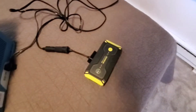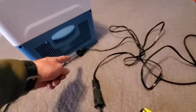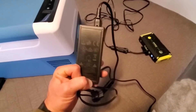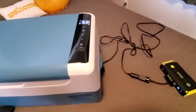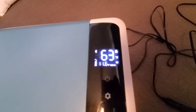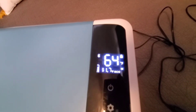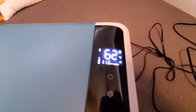All right, we're here with the Power Run. This is the adapter - you just plug it in there, I'm at 98%. Then this one goes to the DC output. This is super cool because it's a DC 12 and 24 volt output - but you lose power running through an AC inverter, so if you're running through an inverter it's not going to work as well. We can see it's an unregulated 12 volts, meaning as the battery voltage goes down this 11.6 will go to 11.5, 11.4 and so on down.